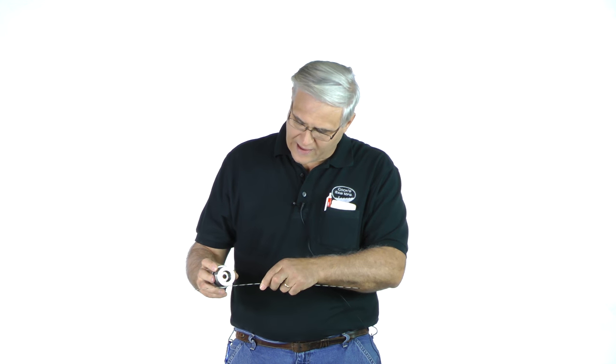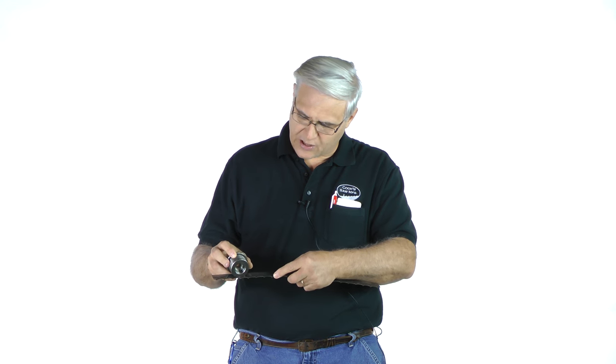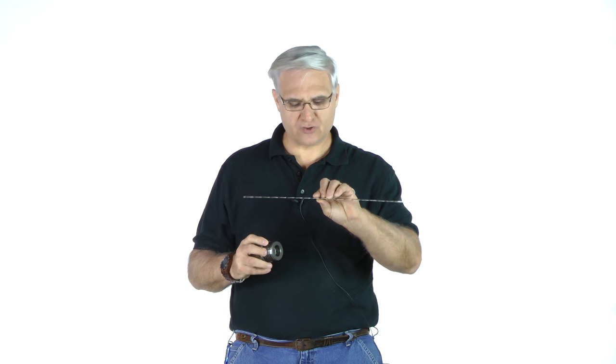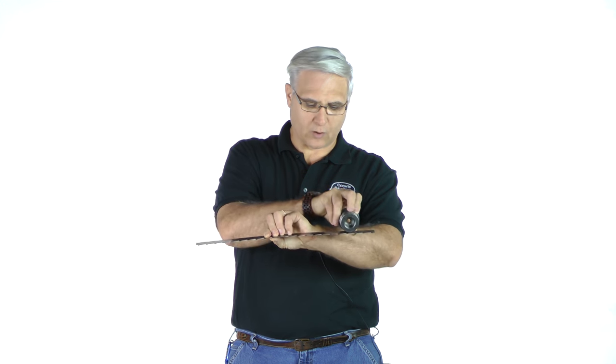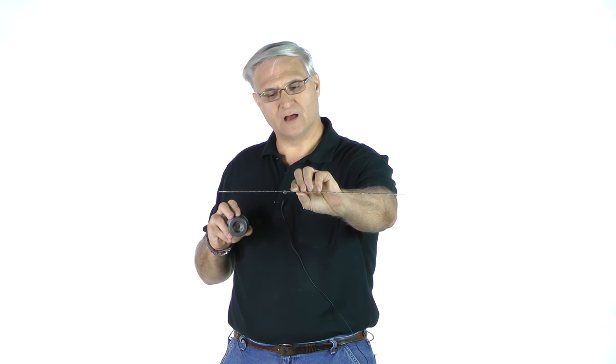We have adjustment on the mill, and probably in our next video, we'll be standing at a sawmill talking about vertical alignment. I'll touch on the roller guides there too, so you can see them set up on the mill. They actually adjust and can tilt up or down on the bandsaw blade. That helps us control the blade, and there'll be one on each side, so that it's sawing straight away in the cut, parallel with the bunks of your sawmill. Obviously, if your blade is tilted down, and I'm exaggerating this, then it's going to try to go down. That's why we talk about first reaction in the cut.